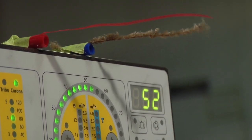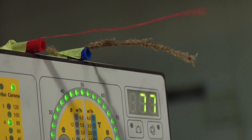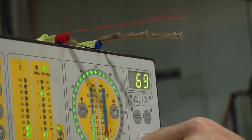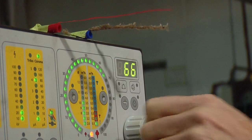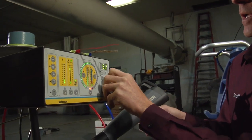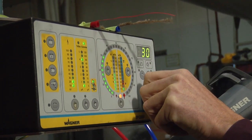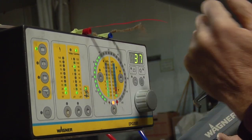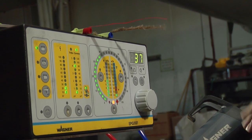As we go up with the powder, you will eventually see the atomizing air completely drop off — and there it went. We use the atomizing air to clean our screen, so we have to have some atomizing air coming out. We can guarantee operations at 65 to 70 and below. The reason the inline sieve has a better density cloud and lower velocity at mid-range settings is because as we go down to the 30 to 35 settings, all that air coming through your powder line goes to your part. With our pump, we're using it to clean the screen, so you're not seeing all that at the tip of the gun.